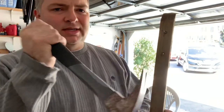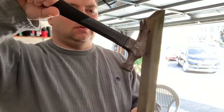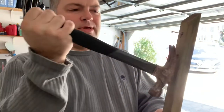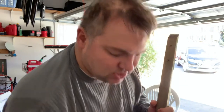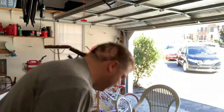What you're going to see right here is with these spindles, I've actually hit the nails out from the back end, pounded them through, and then I'm using the claw hammer to extract the nails. It's just a lever function where you take this and simply take the nail and pull it out. It comes out nice and easily, and then I just drop that off, and that spindle is now clear of all the nails.